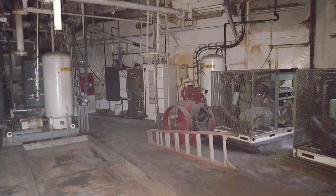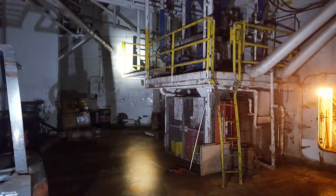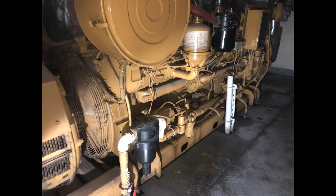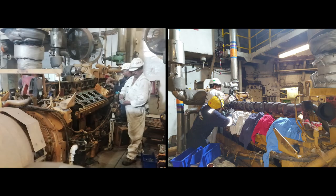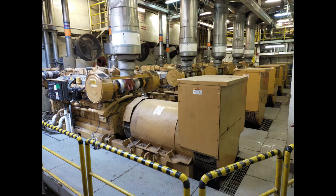The machinery deck areas are cleared of unwanted materials and repainted after cleaning. Around 1,500 square meters machinery area is repainted. Zentech PMT carried out the major and top-end overhauling on three Caterpillar 3516 main engines using an OEM-approved third-party company. The engines were load-tested after the overhaul.